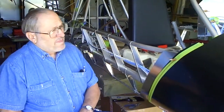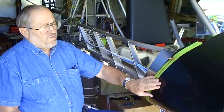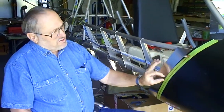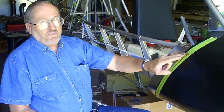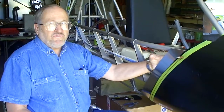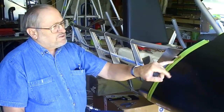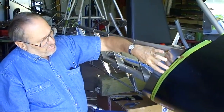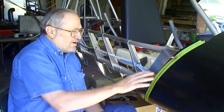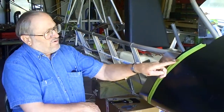I've had a friend hold the nose cone in place, got it even all the way around, and I've put some green painters tape along the edge. I marked an edge half an inch in and I'm going to be putting nut plates in here that will fasten into the support plate riveted to the airframe, so I can take the nose cone on and off. I've marked out spaces where I'm going to drill my pilot holes — 10 on this side and 10 on the other side — holding the nose cone on in the front, and we'll do some underneath on the bottom as well.